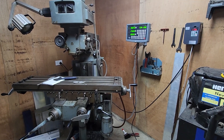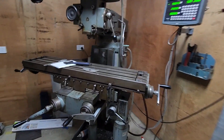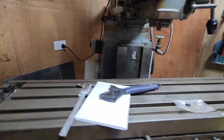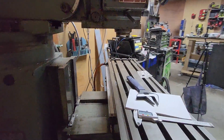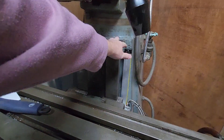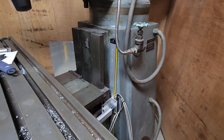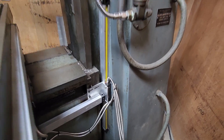I've finished installing the DRO kit on this mill. There are three 500mm linear scales on here. One we had to extend the frame out a little bit using an L bracket to attach it — this is for the Y axis. The X axis was pretty easy, just mounted to the back of the X carriage. But this Z axis, as you've seen, was pretty difficult to install. I think I was drilling too close to the edge of this casting, so when I was putting taps through, I was hitting the side of the casting and snapping the taps. I went through three taps doing that one job. You can see the scorch marks from an attempt to pull out that tap. But it's all installed and functioning correctly.